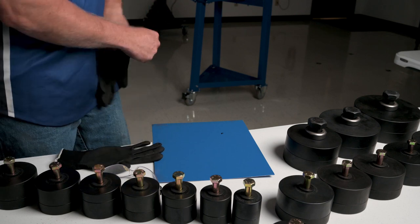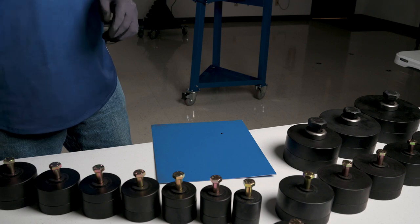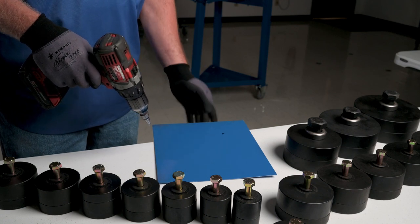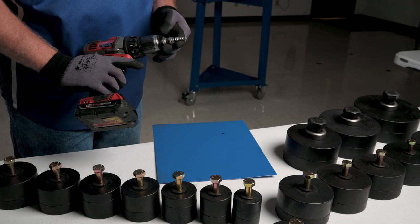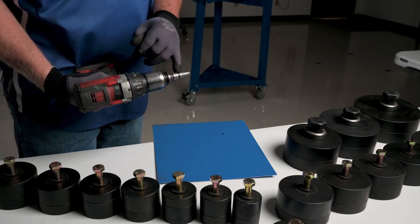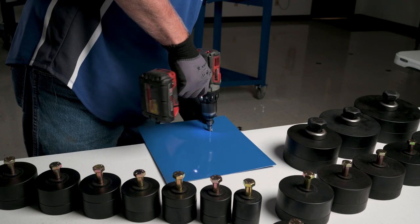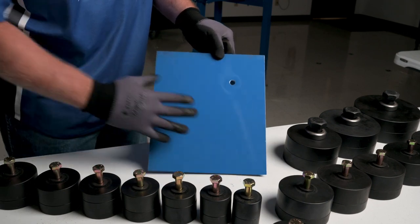Move our stuff out of the way, put our gloves on to protect our hands from the metal, safety glasses on, and then we'll get our drill. Here I'm using a step drill, which I prefer in thin sheet metal. You can use a standard drill bit as well, but in my experience a standard drill bit through thin aluminum tends to grab and twist, making for an ugly hole and can tweak your metal. Using a step bit works great. I'm drilling to the half-inch diameter step, which is the clearance we need for our bolt. We'll drill until we get through that marked line — now we have our half-inch hole.